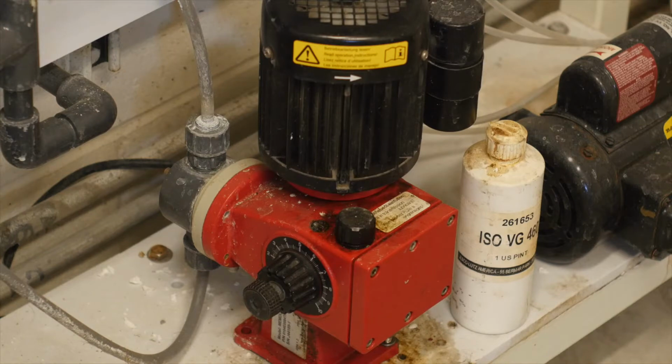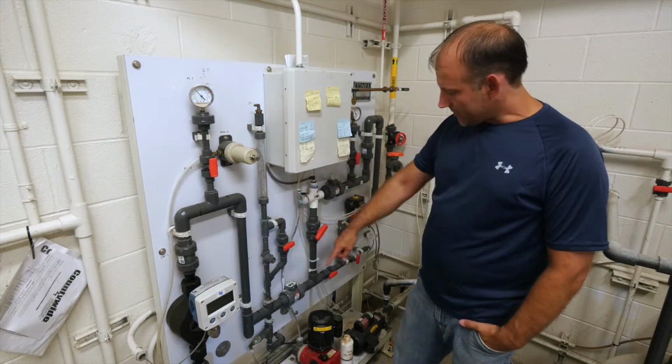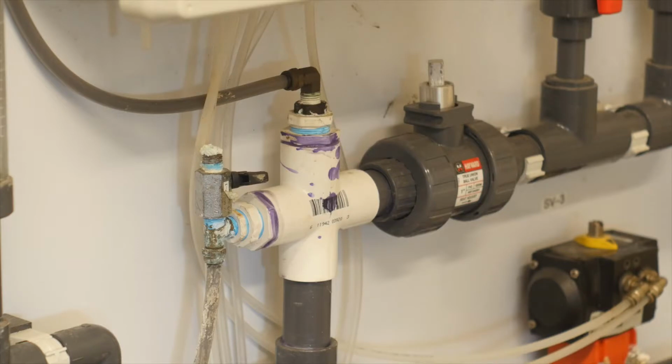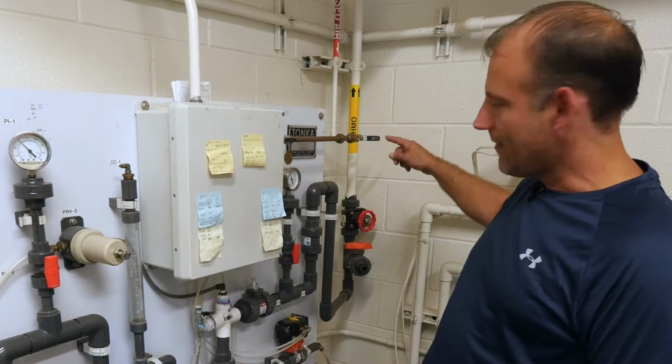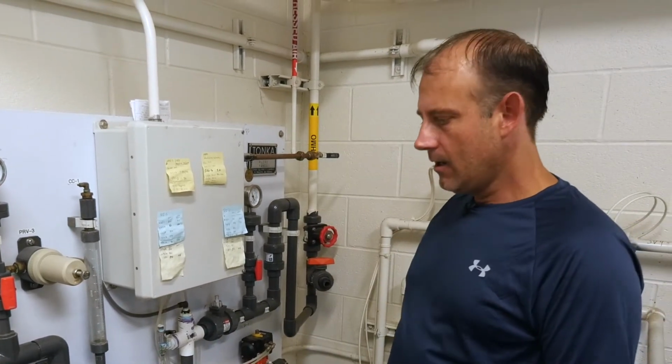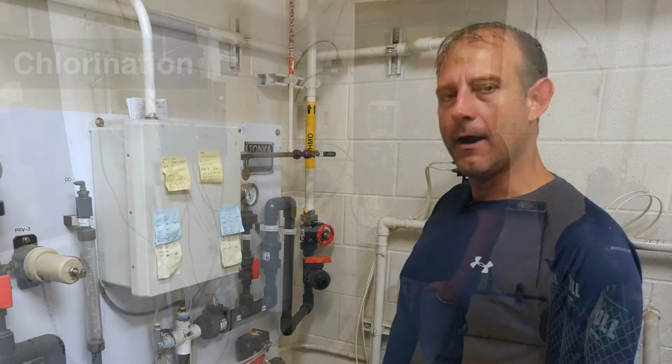This is our carrier pump. It creates up to 7 gallons a minute. The water pumps up this way, makes a Venturi effect, siphons that HMO right into here. It's blended that way, goes right out, 7 gallons a minute into our filter. That's how we remove the radium.